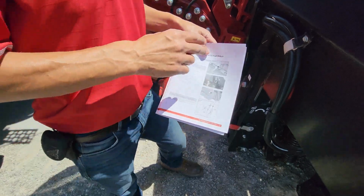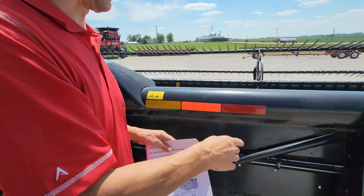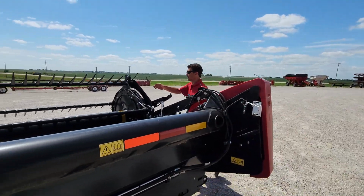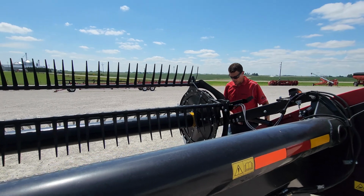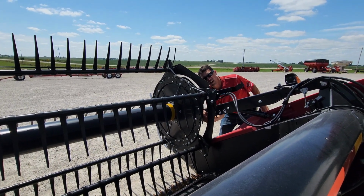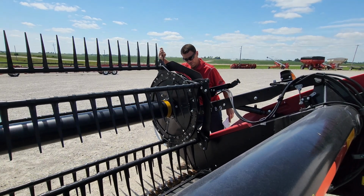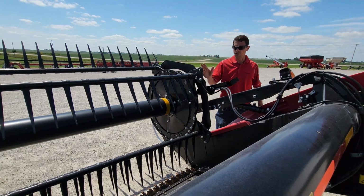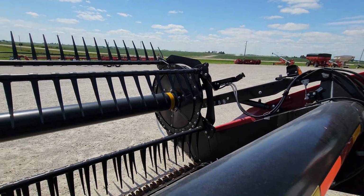And you also want to make sure that when you're looking at your reel position, between this arm right here, I want to see number 5 or number 6 on my decal right here from the combine seat. So make sure that's at number 5 or 6, and then the reel's all the way down. So once you have that all done,